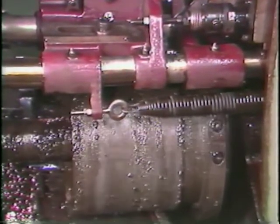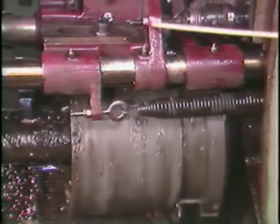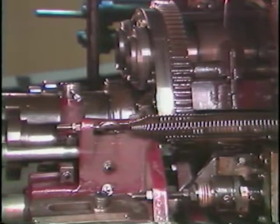These are the stock feed cams, whose purpose is to force the stock feed return shoe to move back and forth. See how the stock cam, stock feed slide, the stock feed pawl, and stock feed return shoe all work together to provide the horizontal motion needed to make the feed system work.